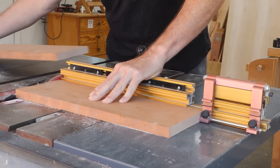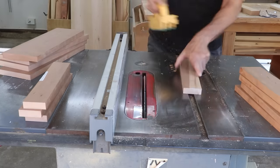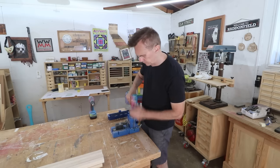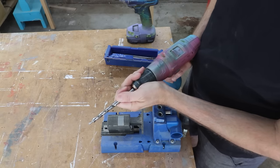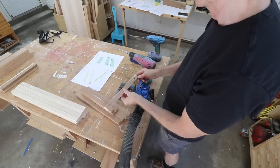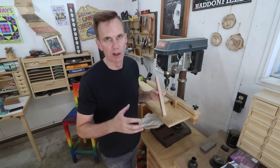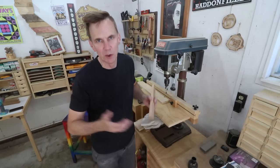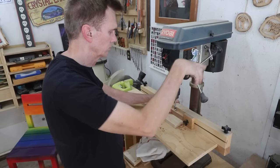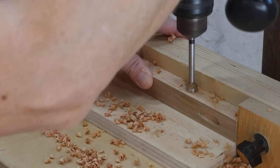Now I can cut out all of the aprons and framing pieces. I'm going to use pocket screws to join all of the frame pieces together, so I can drill those holes now. These two holes are going to be what holds the lower shelf in place. I need to drill two holes in each of the upper side frame pieces — this is easily something you could do using a handheld drill, but using my drill press is just going to make it go a little bit faster. First I drill a half-inch-wide hole about halfway through the board, making a counter bore that'll hide the screw. This is what's going to attach the top to the frame.